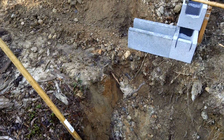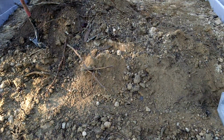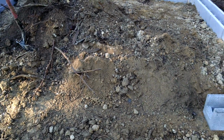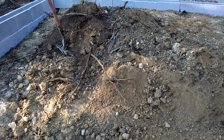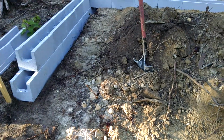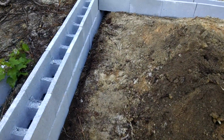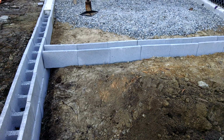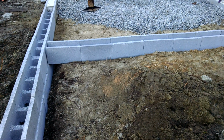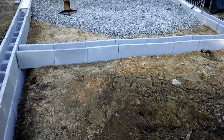So I got to get this end wall done, and start buttoning stuff up and getting it ready to get the fence done and start pouring concrete. Hopefully tomorrow I'll have concrete going in these walls, and then I'll only need another 114 bags. Yay! Because between the 3 pens, it's going to take 114 bags of the 80-pound bags of concrete. So figure 2 bags per mix. That's 57 loads of concrete between all 3 pens.